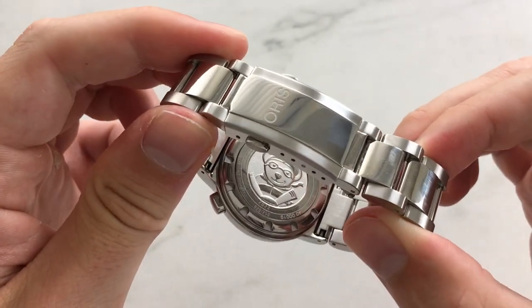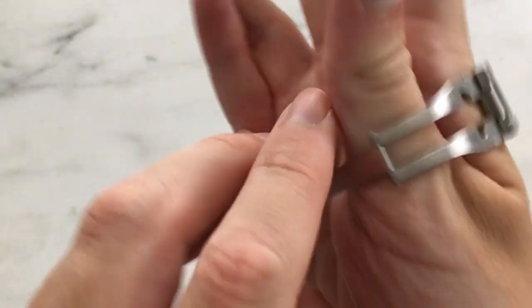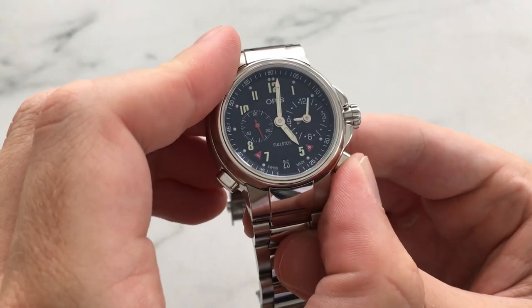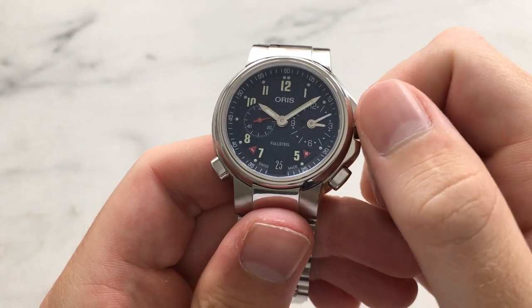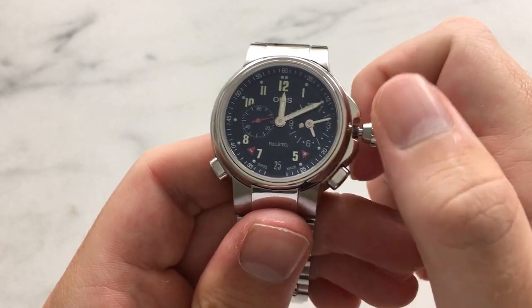What does this watch do? It's called a world timer but I like to think of it as a dual time. The caliber in this watch is the 690, which I believe uses an ETA base, and it offers time and date, small running seconds, a day-night indicator, dual time, and instantaneous jumping hours. You simply set the small dial on the right to your home time, and use the main dial for the time you're traveling to. A few clicks on the pusher moves the time back or forward an hour. If you're traveling two hours ahead, press the plus button twice. As the hour hand passes 12, the date will also change incrementally.